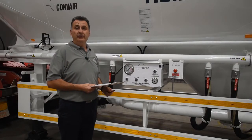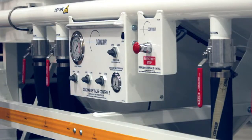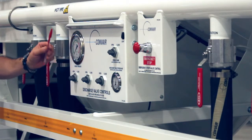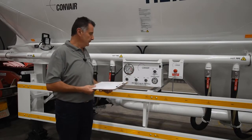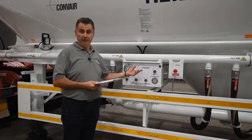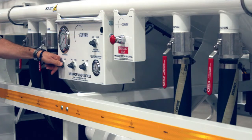Now we move on to the control panel. Check the gauge — it should read zero. Also ensure that you have a visible red line that shows you the maximum pressure you should be running the tank at. We need to check the operation of the pinch valve switches where fitted. Make sure they're smooth and there's no leak.